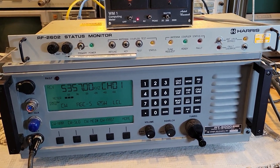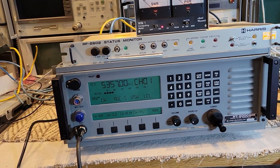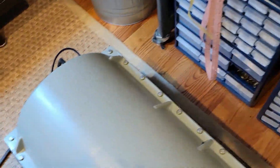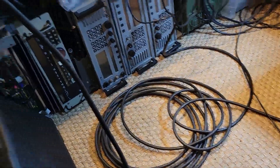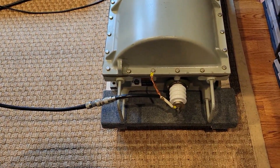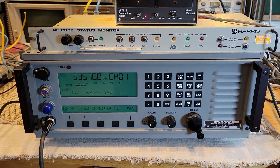What I've done is set up a little experiment using this SunAir. I've got a bunch of SunAirs on the repair queue to see if I can get it to work. I've got a little SWR meter monitoring the standing wave ratio between the SunAir and the coupler. At the output, I have a makeshift high-voltage-to-coax adapter that goes to a patch panel and through some RF routing, ultimately to a dummy load. So it's a long way of saying this is connected to a dummy load. I think I've got it working.